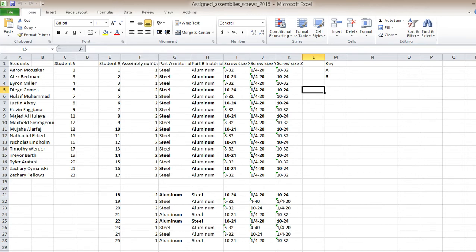And if the screw fits in the hole as it's supposed to for either a loose fit or a free fit, or in the case of the tap hole, if the correct size screw screws into your tap hole. The intent here is so that you understand how to select the proper drill size for either a tapped hole or a clearance hole, and for you to get a feel for what it feels like to drill through aluminum and to drill through steel, and for you to understand how to tap a hole, put threads in a hole, and to understand what it feels like to tap aluminum or steel. So we're trying to get you to understand selecting drill sizes, spindle speeds, and how it feels to actually machine these things. So the actual dimensions, the accuracy of these dimensions doesn't really matter in this exercise.